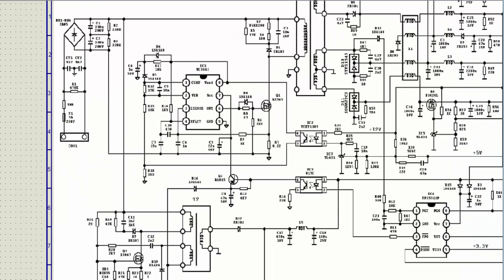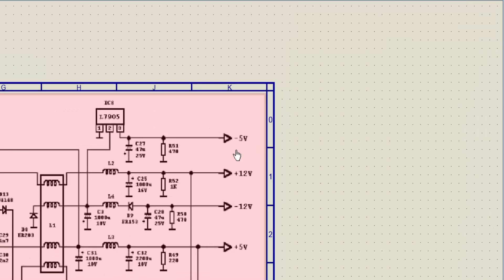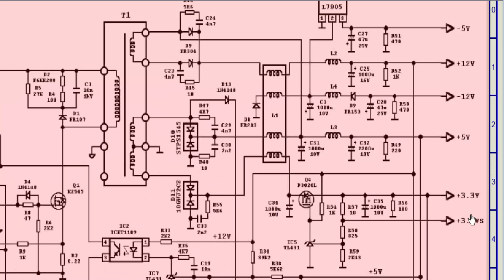At 75 kHz it will start switching to drive this MOSFET. When it starts switching, this transformer will induce voltage in the secondaries. The voltage will rectify and we will take 12 volt from this winding. This winding will provide voltage that rectifies to plus 5 volt. Another end will rectify and apply to this resistor network and PGI power good input signal, rectifier set, filter circuit, and a MOSFET regulator with TL431 to ensure 3.3 volt regulation. From this rectifier we also take minus 12 volt.